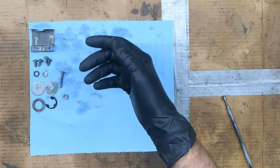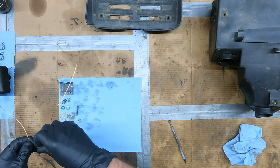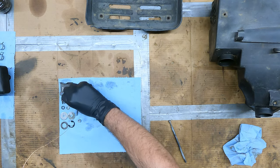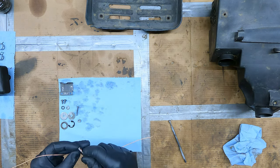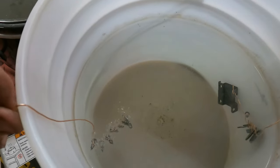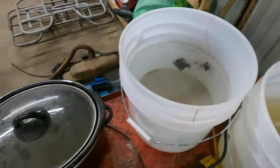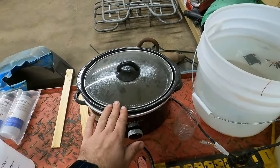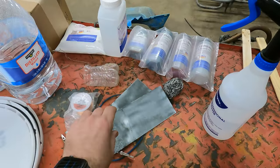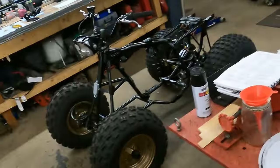I've got about half the stuff out of here — the other half still needs more time to soak. What I'm going to do is use this copper wire for the plating. Our next step is getting the rest of the zinc plate that's originally on this off of here, and in order to do that we need to put all these in muriatic acid. So I'm just going to string them up like I need to for plating and let them sit in the muriatic acid tank. When they're done deplating, I can get them right in the plating tank. You can see all the bubbles on them — that's the acid eating the zinc plating off. Once they stop bubbling, I know all the old plating is off. Then we're going to put them in a degreaser which is in a crock pot because it needs to be hot. After about 10 or 15 minutes we'll pull them out, put them here in the plating tank, hook some juice to it, and then material from these plates here goes onto the hardware. That's roughly how this works — we're going to get these zinc plated so we can start getting everything on the four-wheeler.